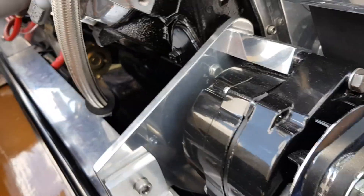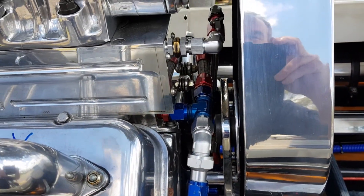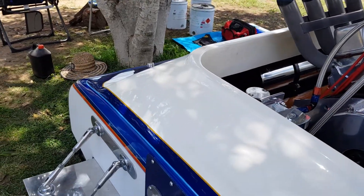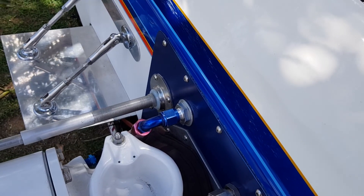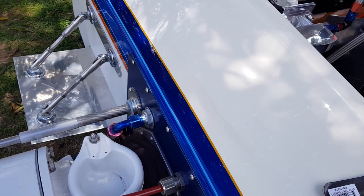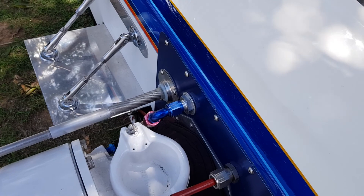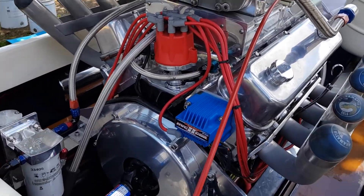The alternator bracket has got an adjustment setup and it's come up pretty tidy. We've changed the water pipes around — we had a little bit of an issue with it getting hot. After investigating, we found a tap on the bulkhead fitting going through the back of the boat, which only had a very small hole in it. That was probably fine for the previous engine but not enough water for this one, so we've increased the size of the hose and bulkhead fitting and removed the tap.